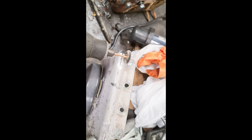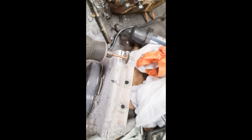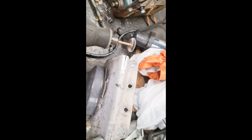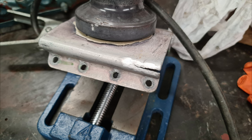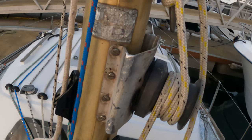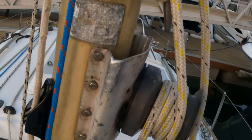I could just make the bracket slightly bigger with some larger radius curves — maybe he could do that. But did I do that? No, I didn't. All that stuff I said about welding weakening the metal — be damned to the welder! In all seriousness, I don't have any experience with welding and I have no idea what grade aluminium this was to start with. I piled in a load of aluminium filler — 4043 I think — so hopefully it's going to be stronger than the non-existent metal that was the crack. That's the theory I'm going with. We'll see how it turns out.